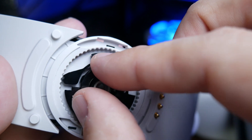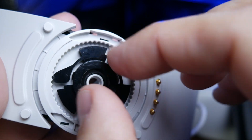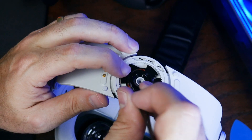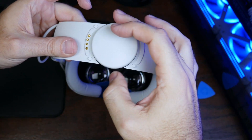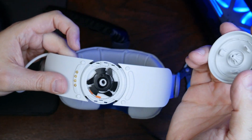The problem with my third head strap was that the spiral arms drooped down so the teeth never interlocked with the teeth in the outer circle. As you can see, the gear just spins and the teeth do not lock in place like they're supposed to. My first thought was to wedge something between the arms and the center hub to push the arms out. I tried using small pieces of 3D printer filament, but as you turn the gear they fell out of place — not effective. I considered gluing them, but decided rather than risk creating another problem, I'd try to actually fix the arms.